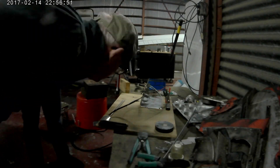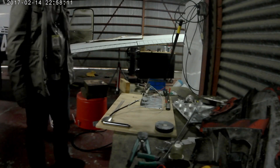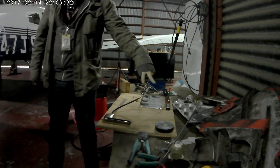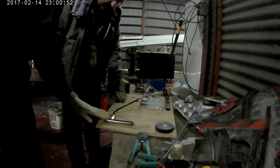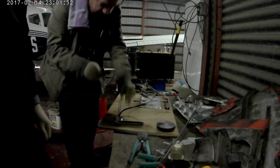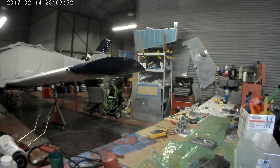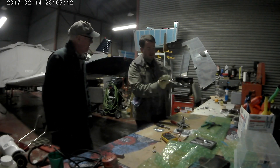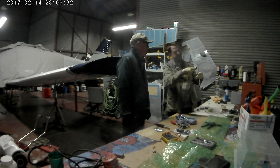It's basically high-resistance filament — just heats it up. Man, does it get hot. We let it run for 20 minutes, and after about 20 minutes, the heat crept up about an inch up the tubing. So I can definitely see why they need to have an 8-inch clearance.